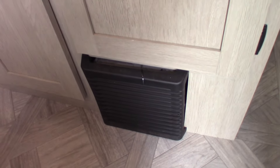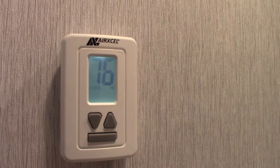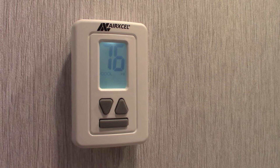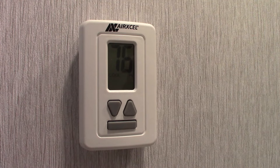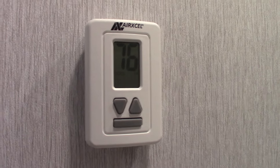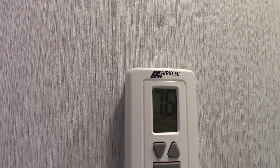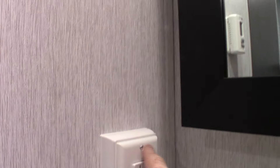Your keys will be hanging right on this faucet. That's your furnace right there. The thermostat is right here — hit the bottom bar, the mode button, to light it up. You can scroll through: right now we're on cooling, which is air conditioning. You can also go to heat, which runs the propane furnace, and fan, which is just the air conditioner running without the compressor — it just circulates air. So three options: furnace, fan, and air conditioning.